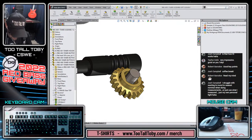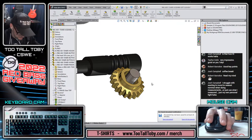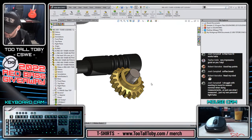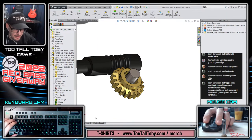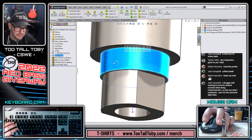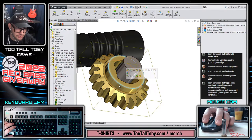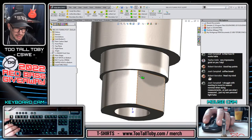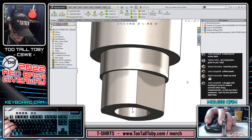Looks like it's gonna be, I'll leave this here so you guys can see it, this edge here, which will be the candidate for the mate reference. This is an edge which shares a cylinder and a planar face. And this is an edge which shares a cylinder and a planar face. So that seems like that would be a great candidate. So I'll pick that edge there, S key, reference geometry, mate reference, hit the green check mark,